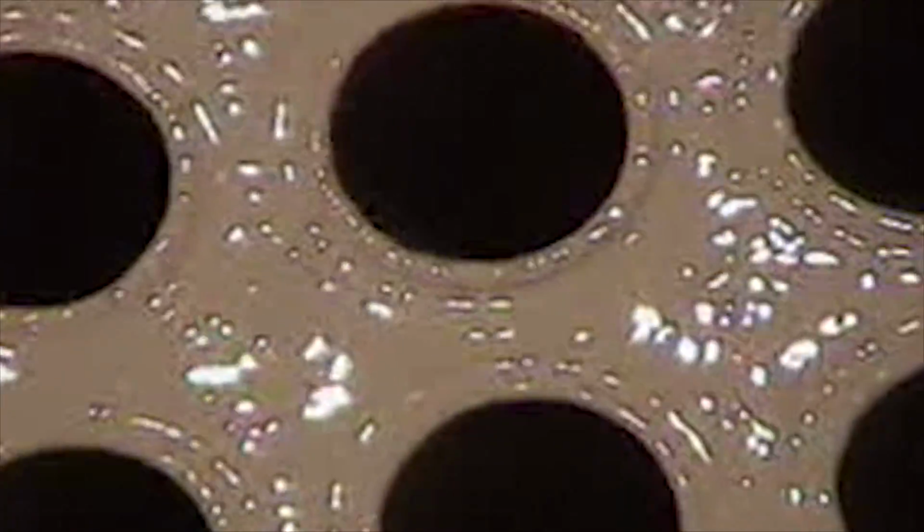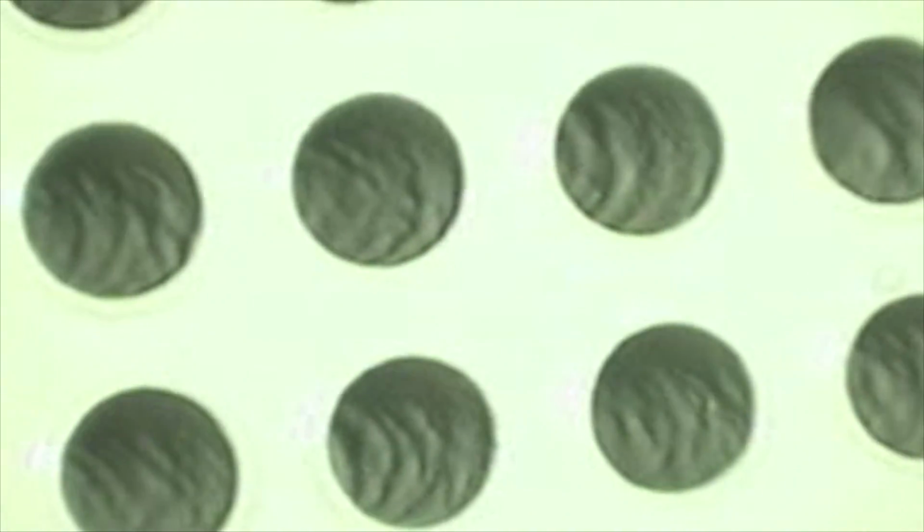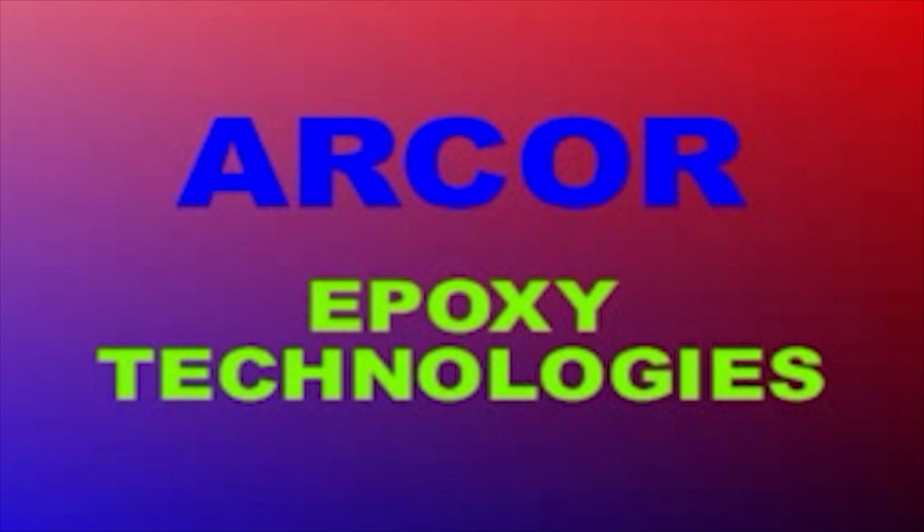Here's the finished product, using a whiz wheel again to clean out any excess coating found on the tube ends. Near the inlet side, you can see the holes and perforations through have been completely repaired, and the heat exchanger is restored to service.